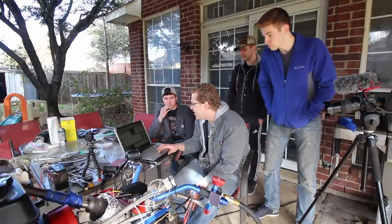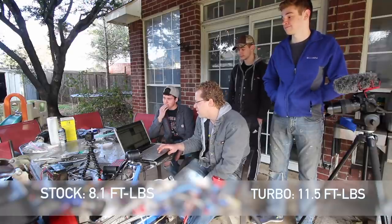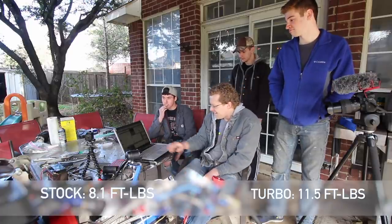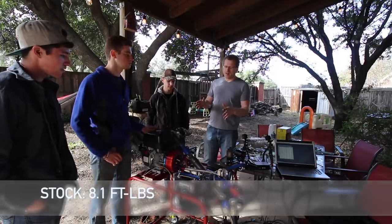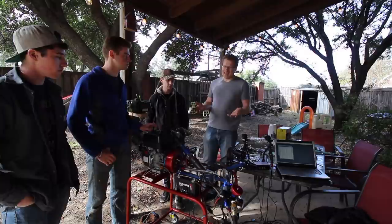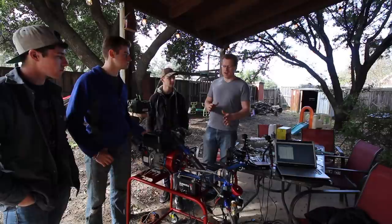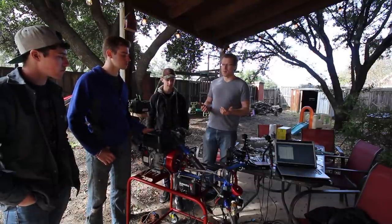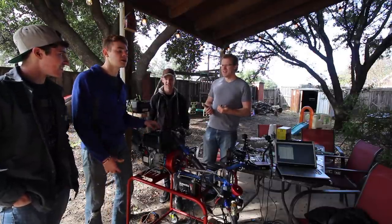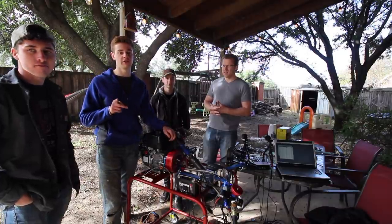Max horsepower: 3,900 RPM, 8.185 horsepower. Max torque at 2,900 RPM: 11.5 foot-pounds. Good improvement. The dyno, since it is a brake dyno, we were able to get full boost but it was under partial throttle — it was kind of lean. I think there are some improvements to be made with jetting and getting the air-fuel ratio right so it can get full boost, but the numbers are undeniable. The lie detector is right here. We made 11.5 foot-pounds of torque and 8.185 horsepower.